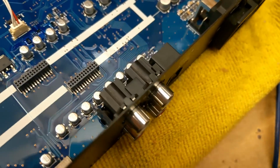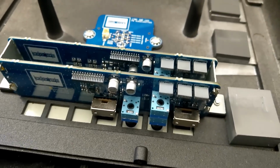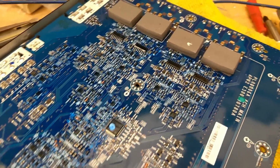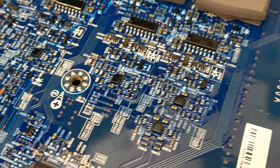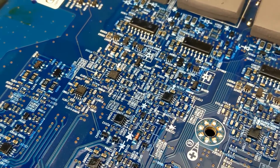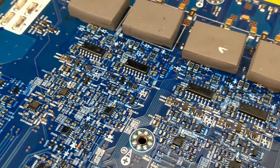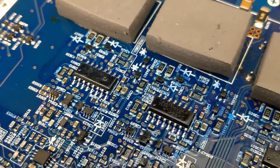Signal source obviously coming in on the RCAs, and then the preamp circuit is actually on separate headers, which is still in the case here. Got some op amps for applying low pass filter, high pass filter potentially, gain, etc. Then when the signal comes back into the main board, it gets converted into pulses ready for the Class D output section. There's lots of circuitry over here for each of the 4 channels, which will be converting the audio wave into pulses, doing all kinds of feedback stuff for lower THD. Probably lots of nice, clever stuff going on here by Alpine to make this Class D sound a little better than your average. Once the audio signal is in pulses, it's then fed to the output drive ICs.